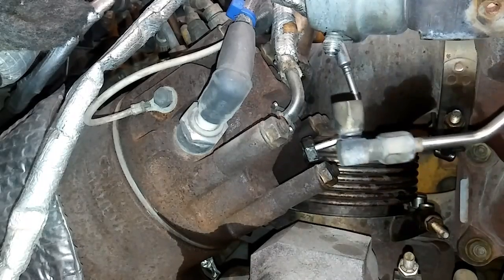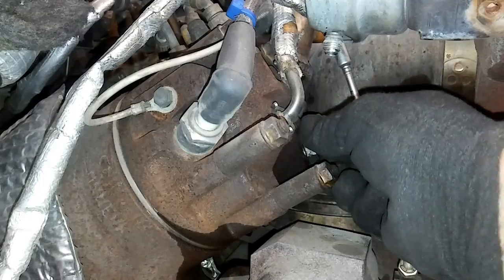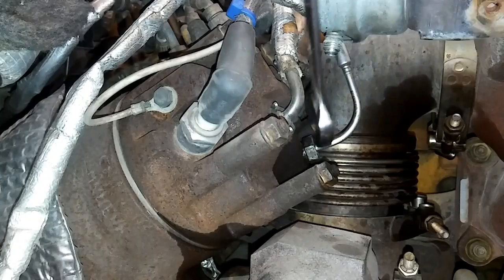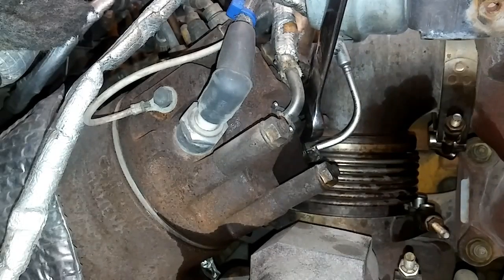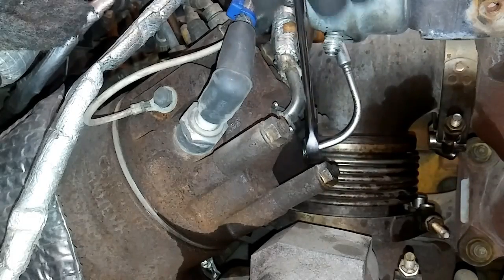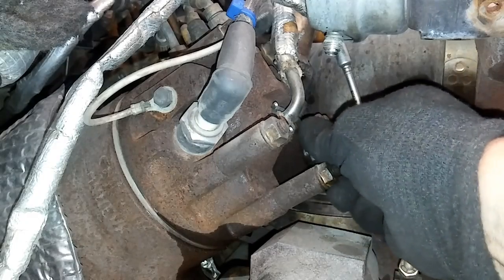Once you've removed the waste gate line and loosened that clamp to get a bit more access, you should be able to spin it by hand. This one is still a bit warm so I'll turn it a little more with the wrench before pulling the probe out. This probe is quite long — about seven inches — because it goes through the aftertreatment head and into the combustion housing to detect flame temperature during a regen.